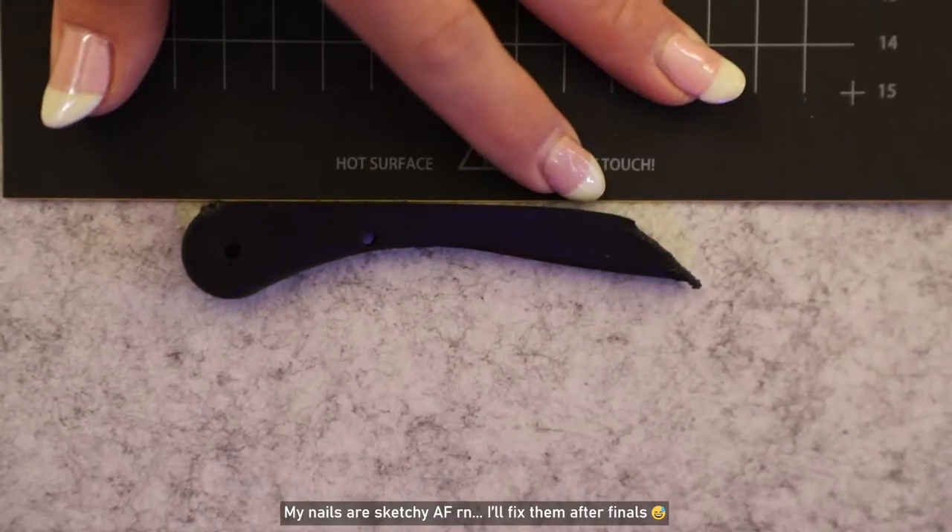We did that so I could print it and see if any ideas came to me. Well, surprise, they did — I discovered several disadvantages with the print. Some of them were specifically related to the printing process. I didn't consider it at the time, but you run into a problem with 3D printing when you print long straight lines — they're much more susceptible to lifting from the print bed. That happened to me. Even though I generally have dialed in my settings to the point where I'm not suffering any problems with bed adhesion, the hammer still broke loose.